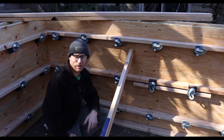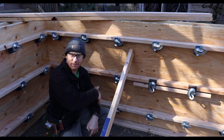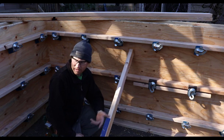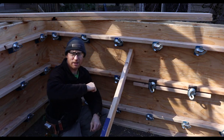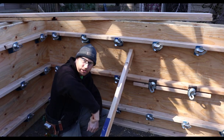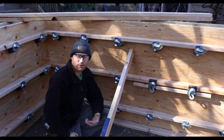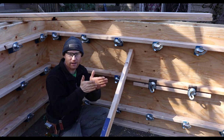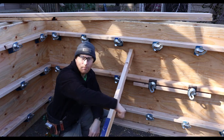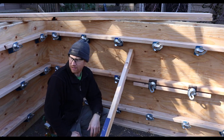That being said, these rebar caps, typically, once you get these walls one-sided, the rod busters will come in, set all their rebar on the inside of the forms, and then you close it up from there. Make sure that they don't pull your ties out of alignment, because a lot of times they'll tie their bar onto your ties or set it on top. So when I'm reaching in and I'm moving those ties to close my forms up, a lot of times you don't have as much freedom. Number one, the wall's half as thick because now you have at least a single mat of bar in it, if not two. And you just have more stuff in the way that's locking your ties into place, especially if they tie their bar to your ties.